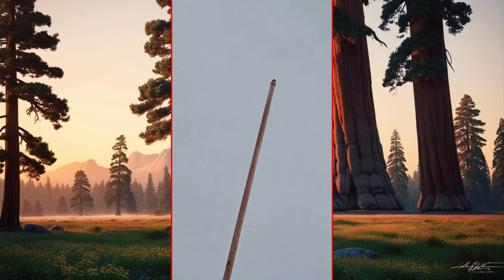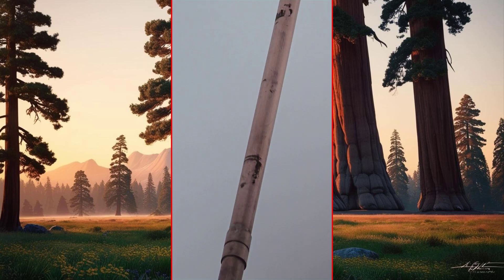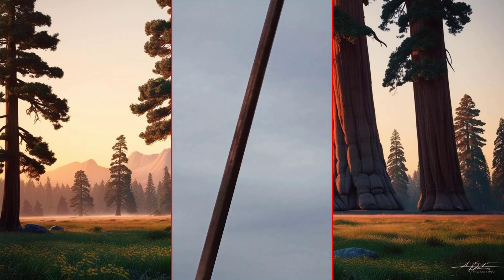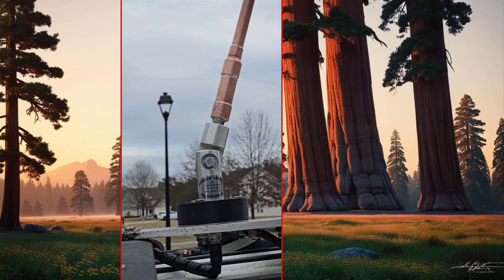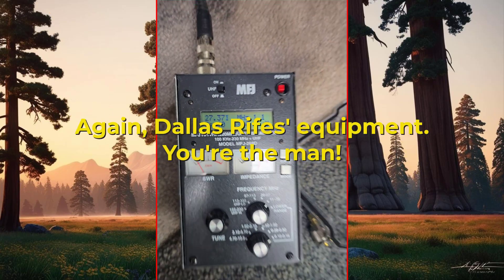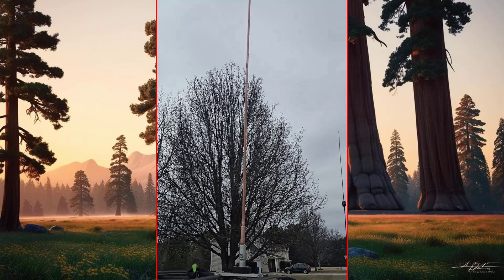So I figured okay, I'm just gonna put it back on the vehicle and tune it up like I have the last antennas. I ran to the store and got another 55-inch half-inch copper pipe, threw it up there, and it immediately tuned from whatever I had cut it down to. I put a coupler in the middle. I didn't want to subject you to all of my cuttings and tunings and misgivings — it was horrible — but I'm showing you now the end result. I magically found the happy resonance and SWR with the 92-inch pipe.